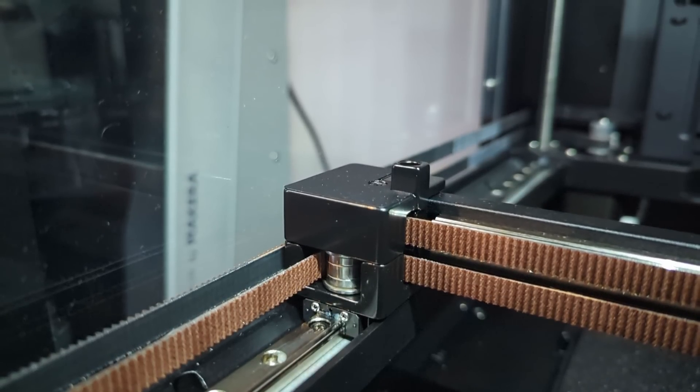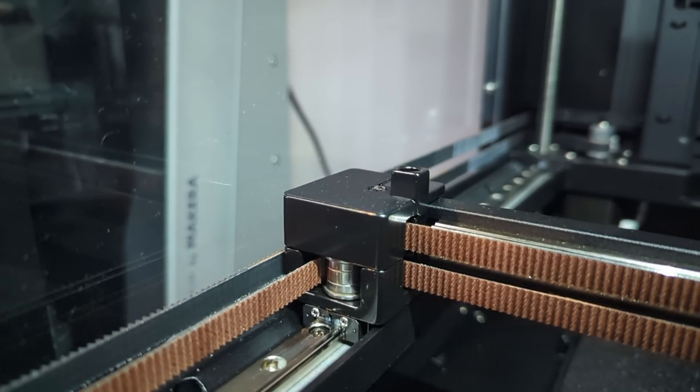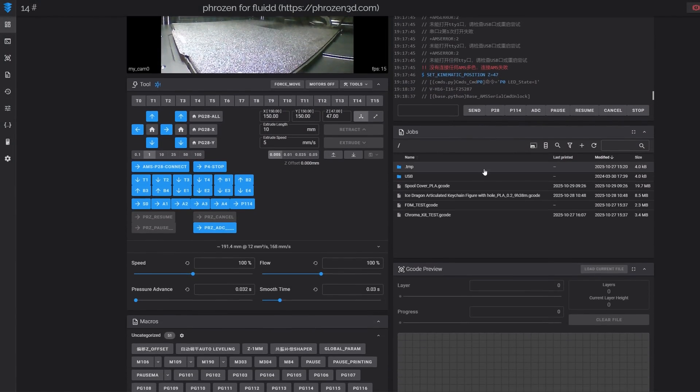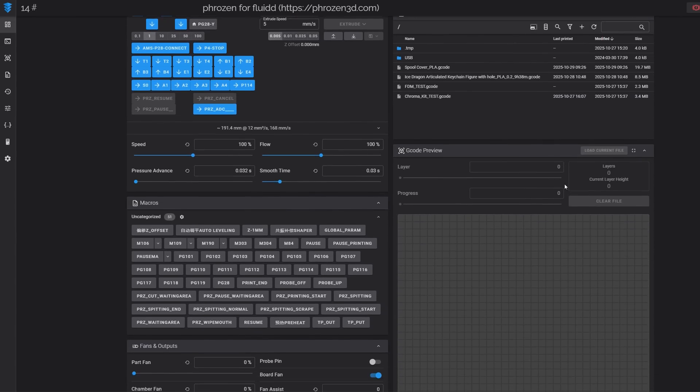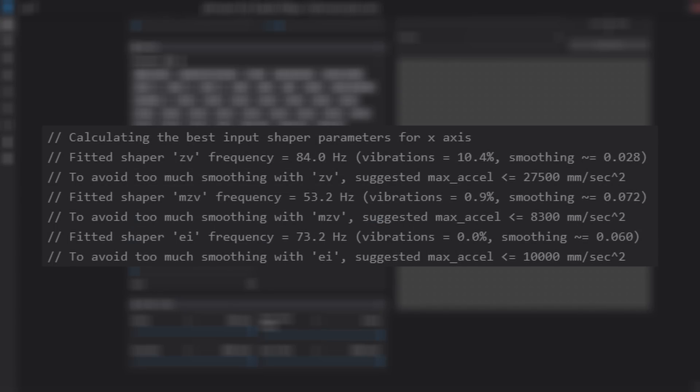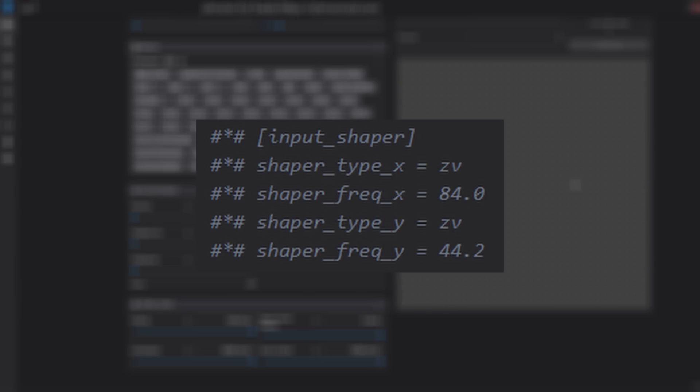Now that we've found the source of the belt artifacts, let's dig a bit deeper into the acceleration artifacts. The cool thing about the Arco is that it runs Klipper with Fluidd as the web interface, so I was able to access it over the network and run a manual input shaper test. The calibration showed over 27k on the X-axis, but with over 10% vibration — that's quite high. And yet the firmware defaults to a ZV shaper, which honestly isn't ideal here and is most likely the reason for the vibration artifacts we saw earlier. Switching to MZV would cut those down significantly.